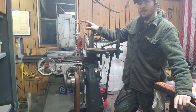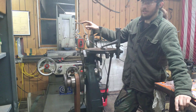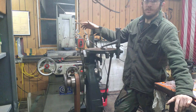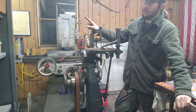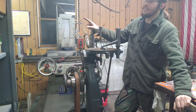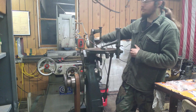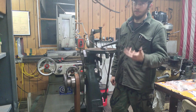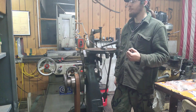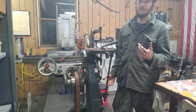With small machines, if you say 220, typically what that means is 220 single phase, because most small machines are 110 single phase. But he said 220, which is correct, but with bigger machines, if you say 220, it's implied that it's 220 3-phase. But I kind of assumed when he said 220 that it meant it was 220 single phase.